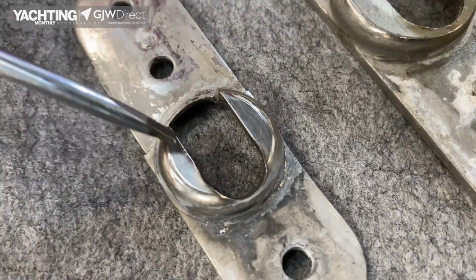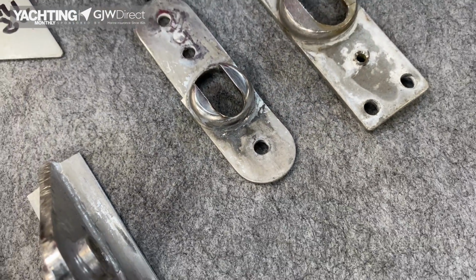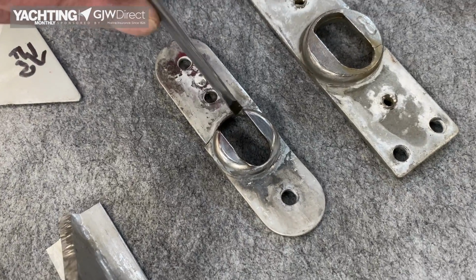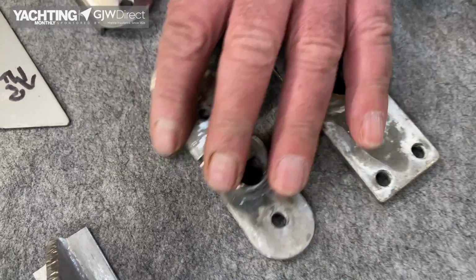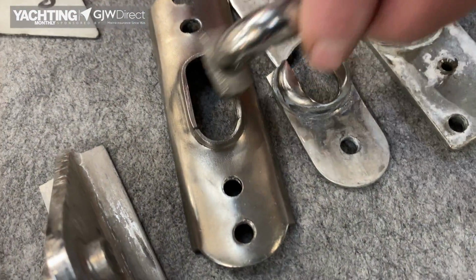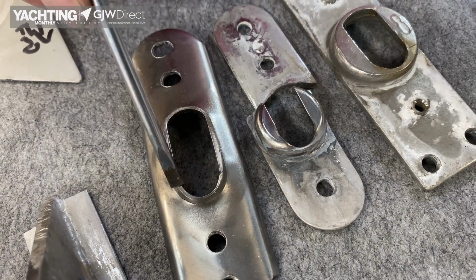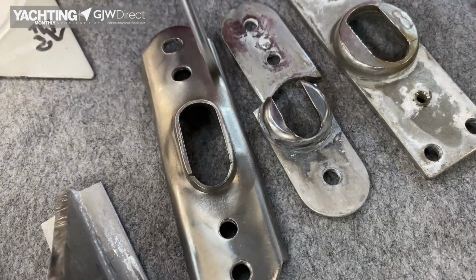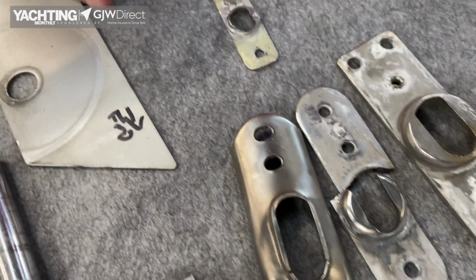And it was probably hanging inside the mast, and then when you looked at it closely, looking for cracks across the top, if you look in the corners, you'll see the crack. Take it out, it comes out in two halves. Cylinder again, different type. Same with the terminal, hooks in, cracking around the bottom, both sides. We've cleaned this one up, but I don't think it was protected. I can't remember if it's a check stay or runner.